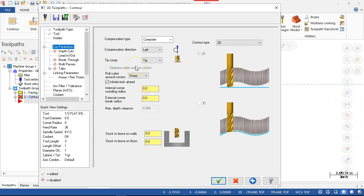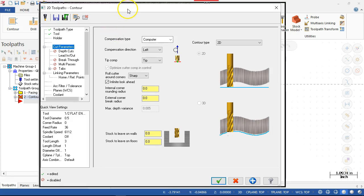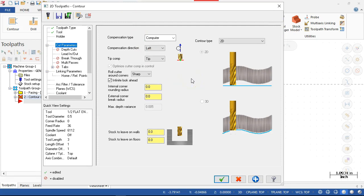And cut parameters. Let's see, we're telling it to go 0.75, so if we go with a depth to diameter ratio of about half, that would be quarter inch deep for end mill, 0.33 about the max. If I pushed it to 0.375, I could take it in two passes. All right, but I'm approaching that three quarters depth to diameter as opposed to 0.5. So 0.5, or the half, is going to be much gentler. The three quarters is going to be quite a bit more aggressive.